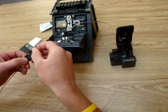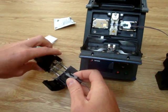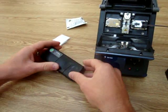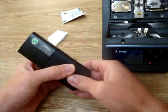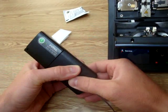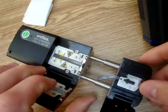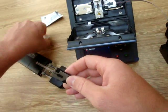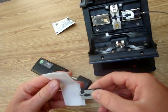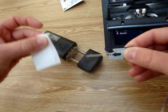Insert an inch and a half, with the arrow facing away, into the thermal stripper. The light goes red, then blinking, then solid green. Remove the matrix, remove your fibers and your handler, and grab your alcohol pad again.